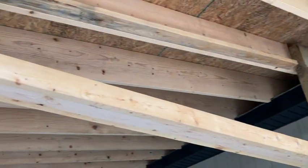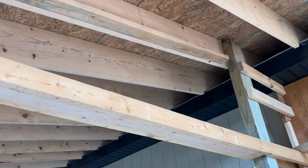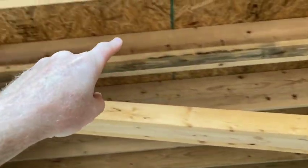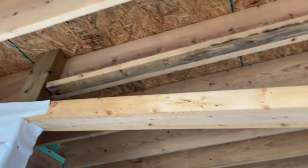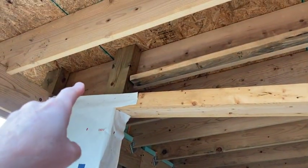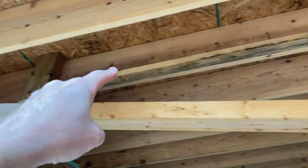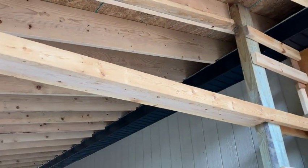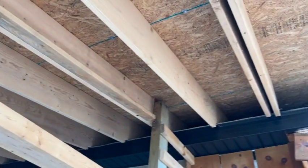So I think what I'm gonna do is I'm going to fill that rafter in with 2-inch foam board for insulation purposes. And then I'm gonna run a 2x4 across there all the way up, so I have something to tie in to the soffit.